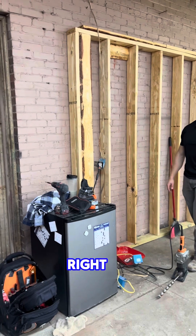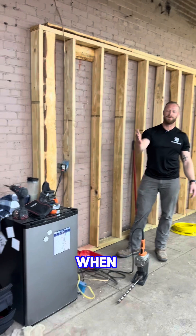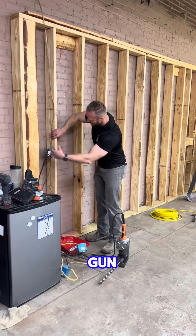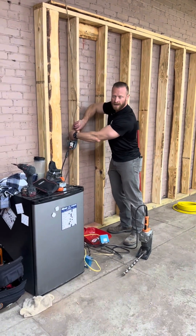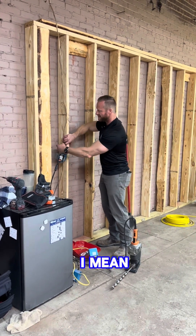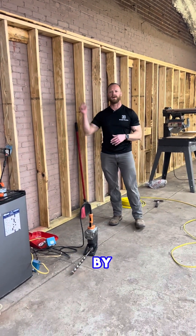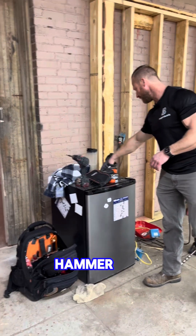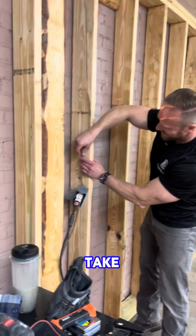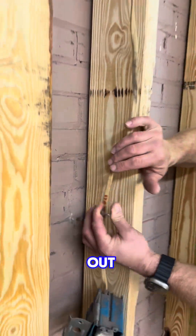There's a maximum distance but is there a minimum? You can just pop, pop, pop if you want. We just got this new Milwaukee nail gun — the guys have so much fun with it — it's literally a nail gun that goes over the top of the staple and keeps the wire from getting pinched by the nail because it's got guards on it. That tool is a little expensive, but the amount of time we save by hitting these nails instead of using a hammer is huge. We'll take it on here and just pound it on to protect the wire and keep it from falling out of the walls.